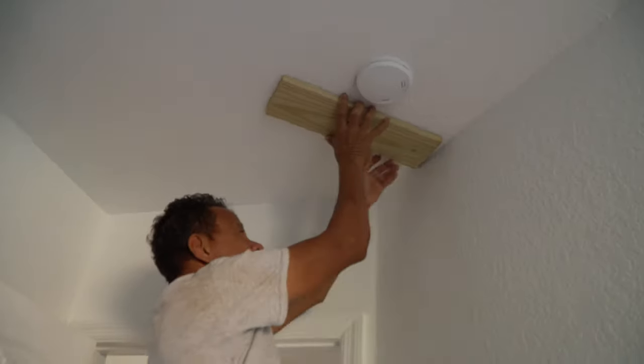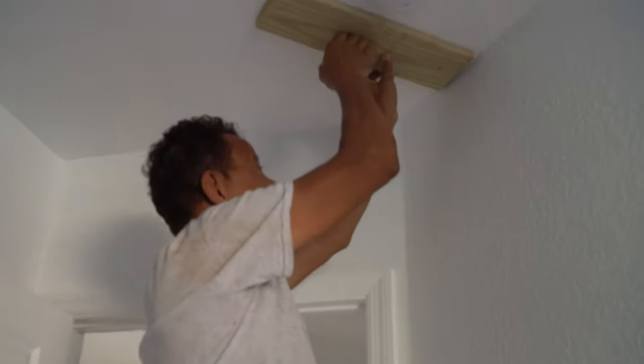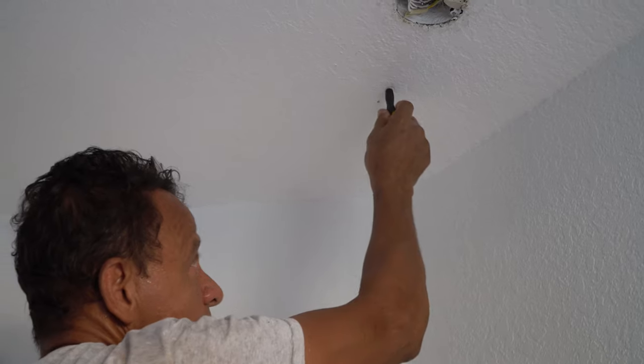The first thing he decided was, instead of installing directly on the wall, install it in the ceiling. By using a piece of plywood in the attic, we were able to drill from the ceiling up through the attic and into the support plywood. It took a little ingenuity to measure things out. At one point we put a screwdriver hole right through the ceiling, then went into the attic to find where that screwdriver was, and knew that's where we'd place the plywood. Once we did that, the thing was firm — it's not coming out. The only way the whole system would fall apart, even with three huge rolls on it, is if it ripped through the drywall, through the support plywood, and then through the beams in the attic. I feel really secure with it — this whole thing is not going anywhere.